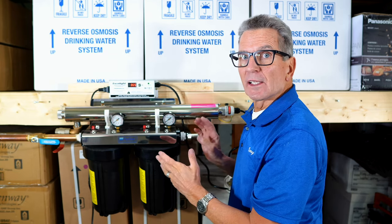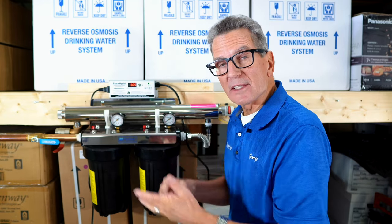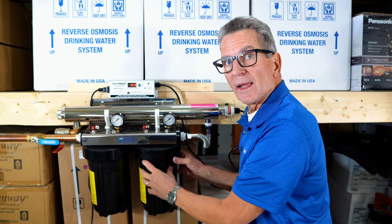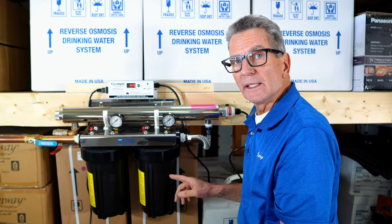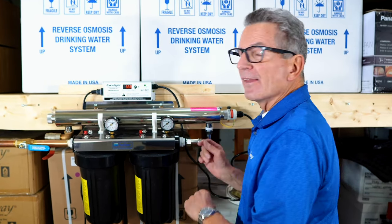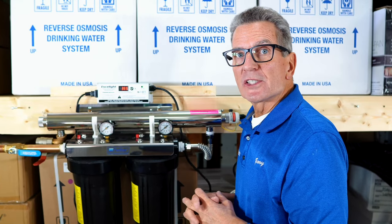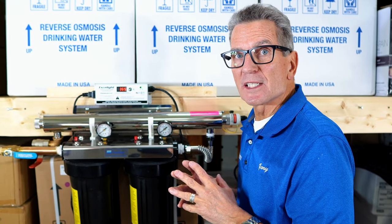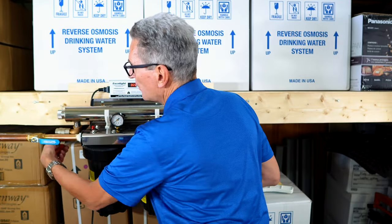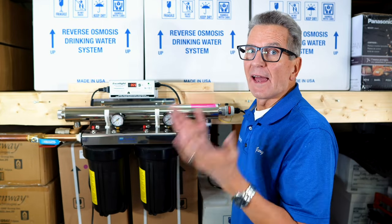If you don't have any leaks, the next step is you have to disinfect. So this is going to kill any bacteria of the water that flows through it, but any water that's downstream of the system, it's not going to kill. So what you need to do, remove this filter and this filter housing, put chlorine in here, bleach basically, about half full, unscented bleach, and then run that out throughout the whole house. Now, I've got a great YouTube video that explains exactly how to do that disinfection process, and I'll put a link in the description down below. Once you've got the chlorine in there, then you can open up the outlet, and like I say, run it throughout the whole house and disinfect.